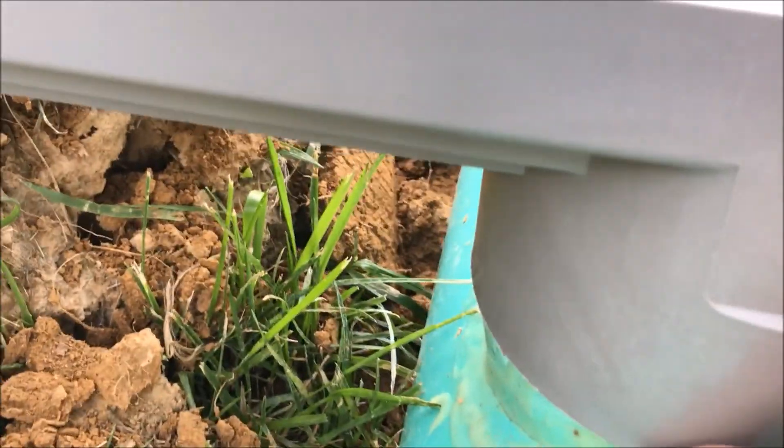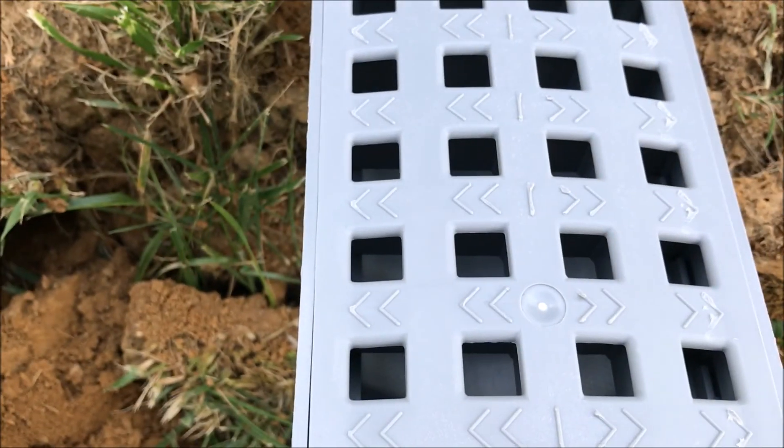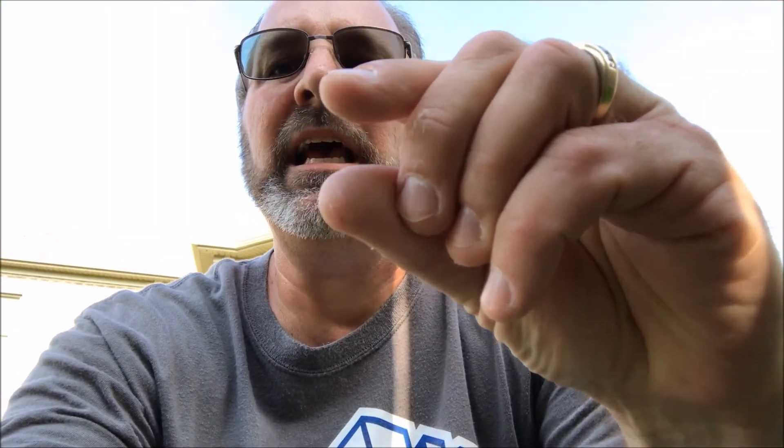What I've got left to do — let me show you. You can see there's about a half inch extra of the green pipe on either side of the drain right there. What I'm going to do is take my Dremel tool and cut — not the whole distance off, but leave a little bit of a lip — cut some of that off for two reasons. A kid is going to step on this drain and push it down, so I want it closer to the pipe. The drain has about a quarter inch lip all the way around it, which will press against the 6-inch pipe and keep it from jamming the 4-inch pipe down into my bigger drain. And it gets me just a little bit farther below surface.